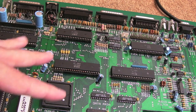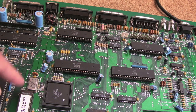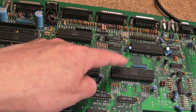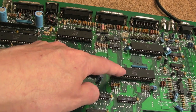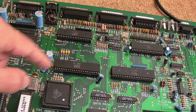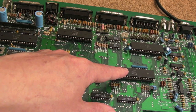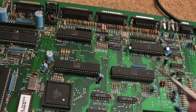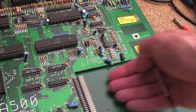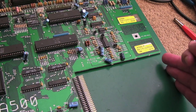The ROM enable - I think it's an active-low signal, underscore ROM EN - comes from Gary. It looks like ROM enable is on pin 12 of the ROM. Gary is primarily the floppy disk drive controller, and there's some bus control logic in there too. I think there's an upper address line in there as well, because if you do a 1 meg chip upgrade - stick an expansion card in and change the jumpers to make that expansion chip RAM - one of the things you have to do is pull one of the connections from Gary.